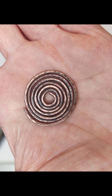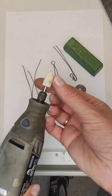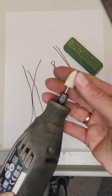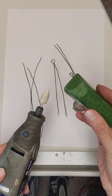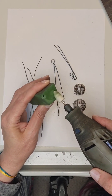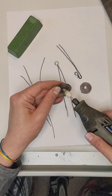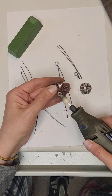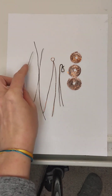We bring everything to a state that pleases our eye. Hands will get dirty — you need to wash them quite often. You can polish even without a drill, but if there is a drill we use special nozzles and polishing pastes. We will polish with a felt bullet-shaped nozzle. It is necessary to use polishing paste such as GOI paste or diamond paste. We start at low speed — take a little paste on the nozzle and clean the part. With a trimmer the speed and quality of processing is much higher; treated areas shine more. Process all details to the final shine, then thoroughly wash all pieces in warm running water with an old toothbrush and dishwashing detergent.